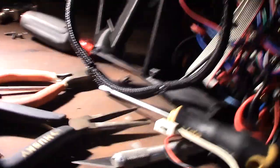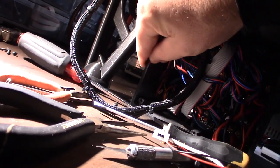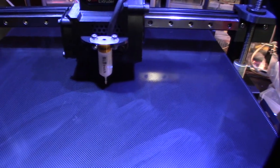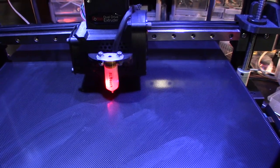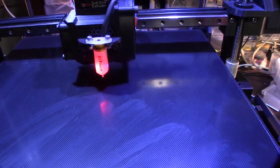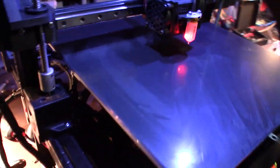I'm going to do a quick experiment. I'll take out the BL Touch black and white probe wires and move them to the actual Z end stop connector to see what happens, because that's how I have it programmed. This might interfere with the dedicated pin 0.10. All right, I moved that pin over — so now the BL Touch is connected to the Z stop rather than the dedicated probe connector at pin 0.10. You could use that dedicated connector, you'd just have to program it in Marlin. But this works fine for me.